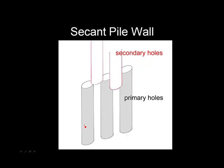You begin by installing a drilled shaft, which is nothing more than a hole in the ground filled with concrete. You skip a space and then drill the next shaft and fill it with concrete, then continue with the third. You can do this for the full length of the wall or for some practical distance.